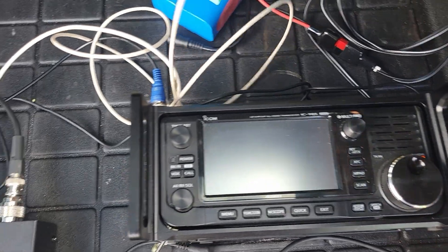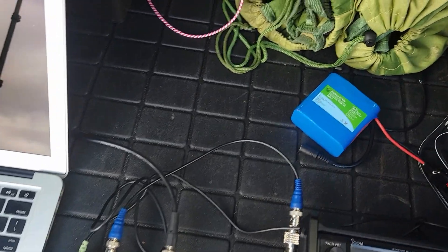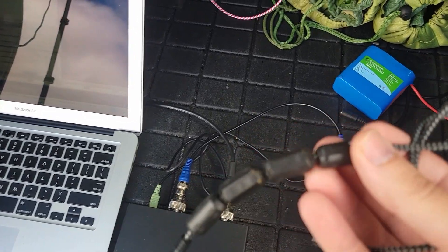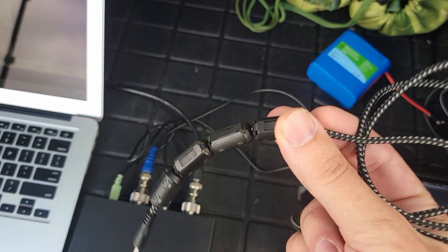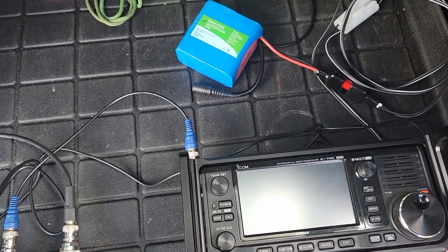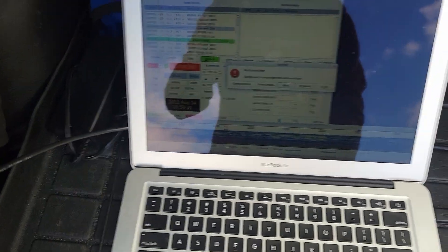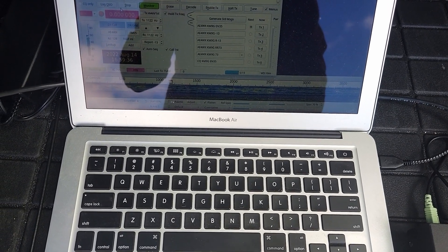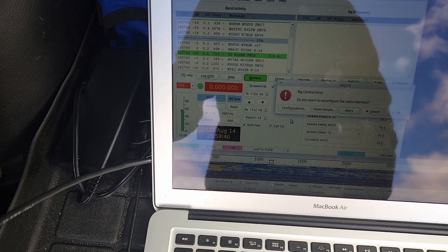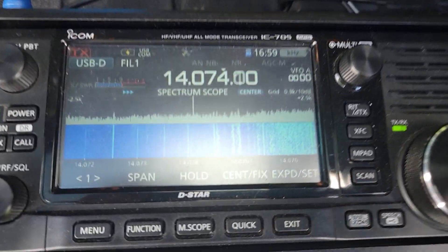So we're turned off. Obviously there's some kind of noise we're getting from just your generic everyday USB cable. What I did to solve this is I went out and got a different USB cable and put these little ferrite beads on. I have a video on my IC706 using this type of ferrite bead to remove noise from the power supply on a Raspberry Pi, and they worked great — I had to use quite a few. So let's get that end plugged back in and the other end plugged into the computer. Let's turn the radio back on. Even with those beads, we still have this huge noise floor.